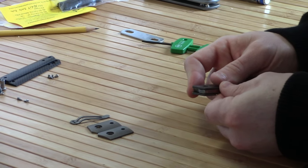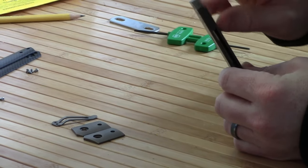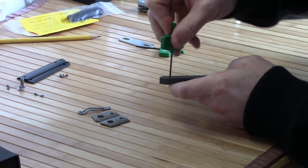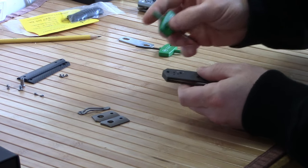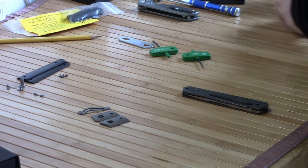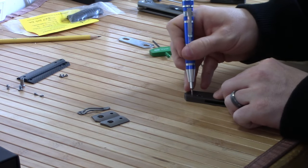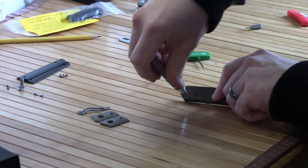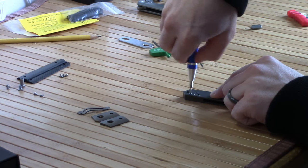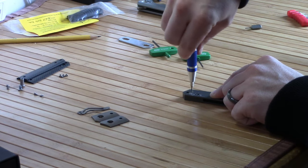I can probably rock the blade out. Actually, I'll take out these screws first — this is holding in the titanium back spacer. I'm going to need something smaller than a T6, probably a T4 Torx to get these little guys out and get the back spacer out, which is the last step of being able to fully take down this knife. There's another little post in here — it's probably steel and goes through the back spacer and both liners.